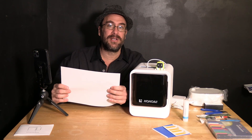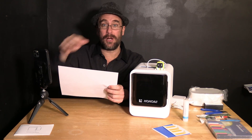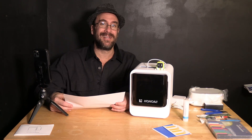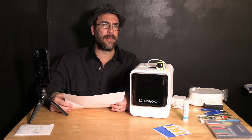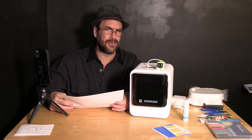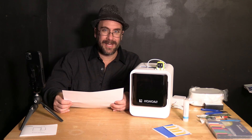When dealing with 3D printers, you hear about build volume — simply put, how wide, deep, and tall of a model you can make. The build volume for this printer is 100 by 100 — that is the size of the print bed and the max height. Installed on this printer is a 0.6 nozzle. A more common nozzle size is 0.4, but this one has a 0.6. That increased nozzle size will reduce the amount of detail this machine can print, however it will be sufficient for most models and the larger size will help decrease your print time.